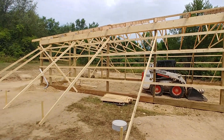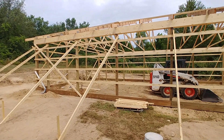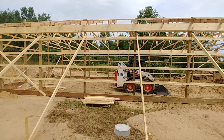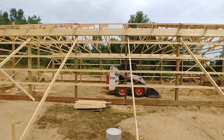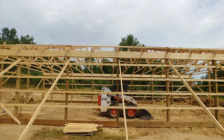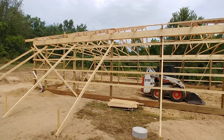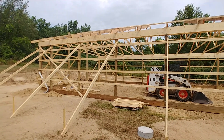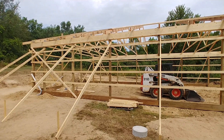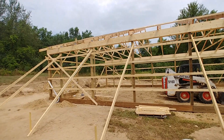What they have here — I believe these were 16 foot posts — four to five feet of them are in the ground, and then they cut a little bit off the top once they got it down to the right dimension. With a 14 foot post you want about four and a half to four and three-quarter feet of the post in the ground.